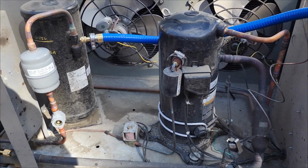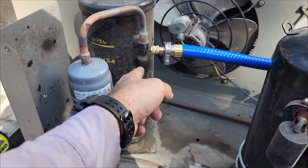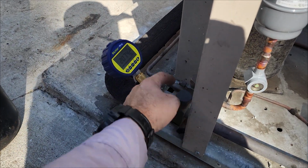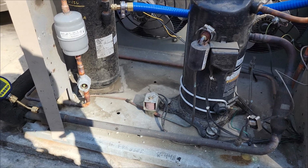Couple things to note. Number one, you always want to put the caps on, okay? Because service valves, king valves like that one, the caps right here, and these caps, Schraders always leak, valves always leak, nothing's leak free. So always do that.